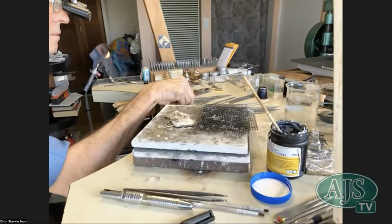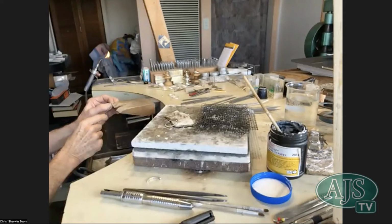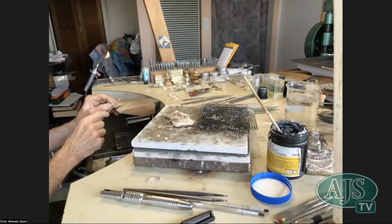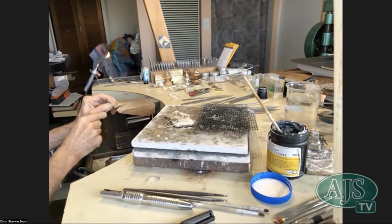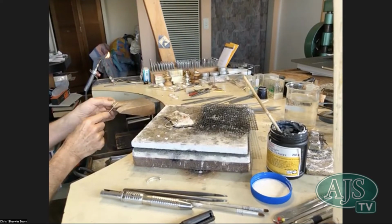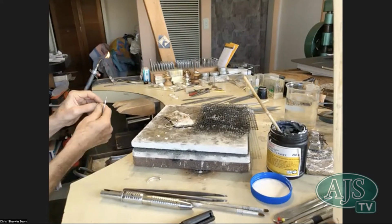So get my trusted little barrette, nice sharp little barrette. All right, that's triangular. Better look harder. That's my barrette there with the safety back on it, and then the cut on the front. And this is a little beauty, this one. I love this file. Just square that up a little bit. Make sure that end's square. Make sure the bottom is nice and flat. A little bit further, I think.